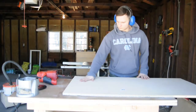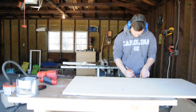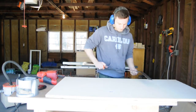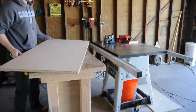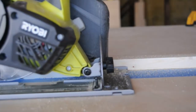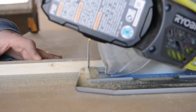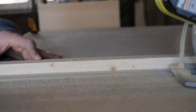Cutting the box walls is a pretty straightforward process. To cross-cut the top I used a framing square to draw a line and my circular saw to make the cut. The board is supported on both sides — on one side by my work table and the other by my table saw, which are roughly the same height. Since this plywood has a nice birch veneer I covered the cut line in painter's tape to avoid chip-out. To ensure a straight cut I clamped a straight piece of wood along the line to use as a fence for my circular saw. I ended up with a pretty clean cut and was happy with it.